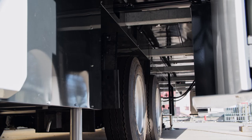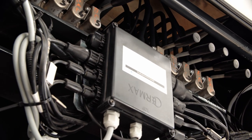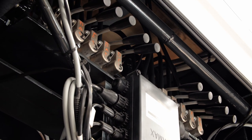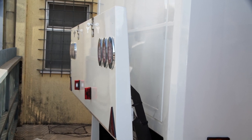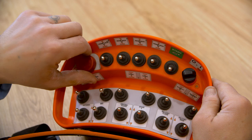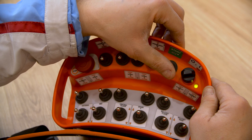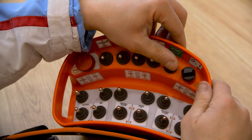In case of failures on the Elka control unit, it is possible to remove it by disconnecting the switch on the CPU. In this case the hydraulic system will work by means of the manual levers only, inside the belly box on the rear side of the vehicle. In case of emergency, if you notice any abnormal movements, push the red main button reset on the remote control. Any malfunction could be due to a change in the density of the oil due to temperature changes, or to problems on the electrical system.